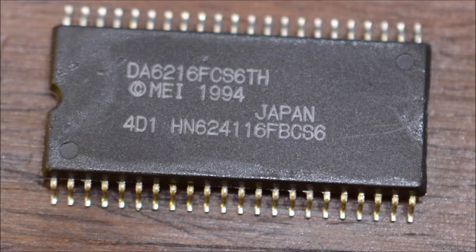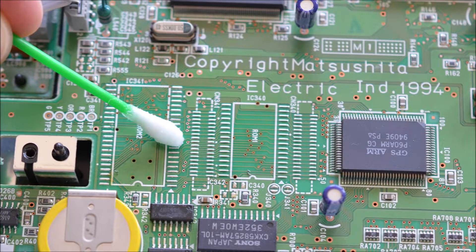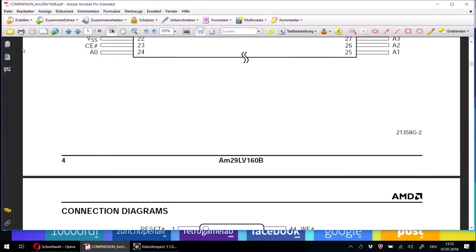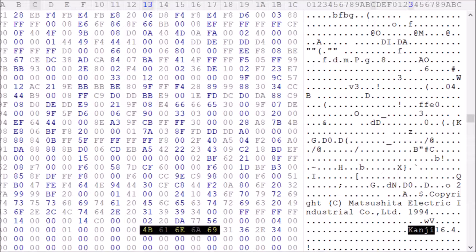Reading the BIOS was no easy task, as the markings on the chip did not reveal its identity. That meant I had to brute force it. First I explored some pin identities for reference purposes and to shrink the list of candidates. Then I googled all available chips for their properties and condensed a list of possible candidates. I then read the chip assuming one of these identities at a time until I got a list of compatible replacements. After succeeding in reading the ROM, my suspicion was confirmed — my chip contains both BIOS and Kanji fonts.